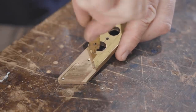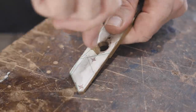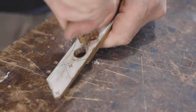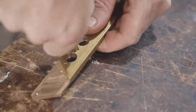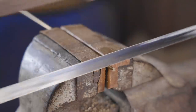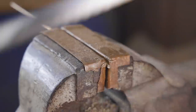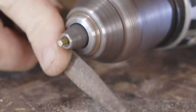So the pins don't come out when they're peened, I'm tapering the hole from either side using a spade bit and doing that by hand. To prevent the ends of the pins from cracking, I'm rounding the ends over before I peen them.